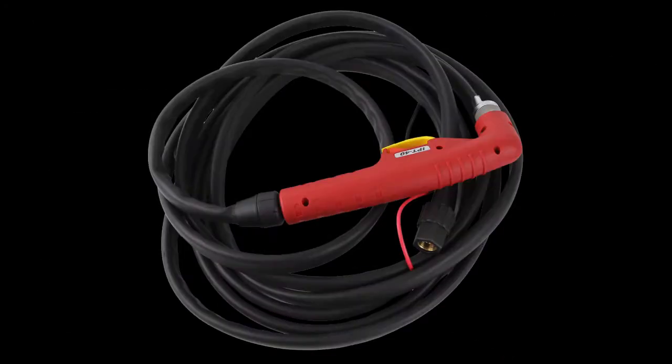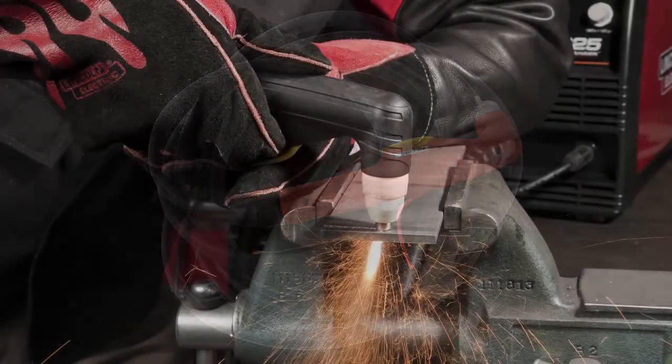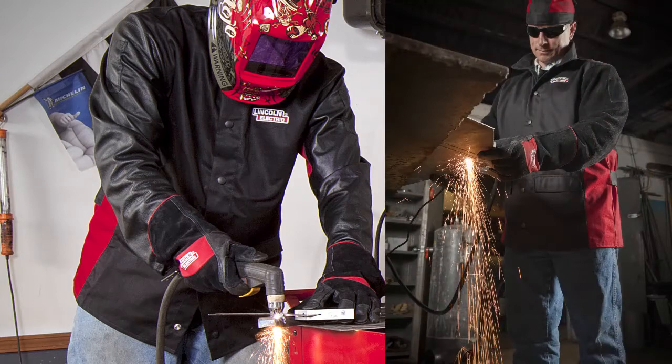Plasma has a bunch of safety features too. You're dealing with hot, hot gas, so you've got to be careful. Plasma cutting will actually tell you when you're going too fast or too slow. If you go way too fast, the sparks will come right back towards you — you don't want that. You want the sparks and all the dross to go down on the floor. If you're going the right speed, all the sparks and the dross will go on the floor, making the right cut.